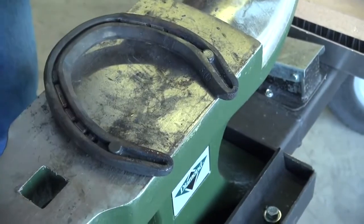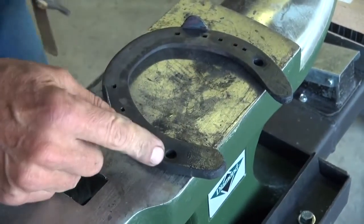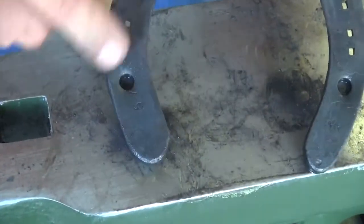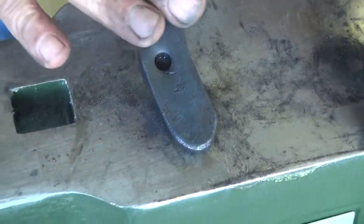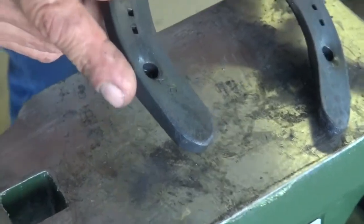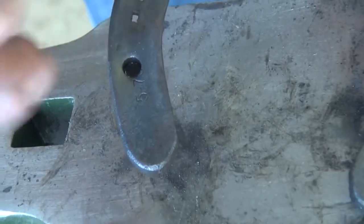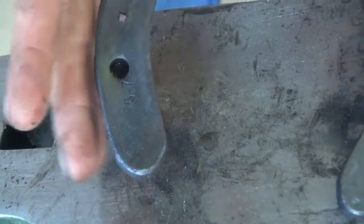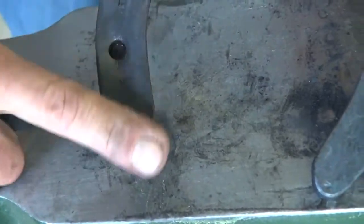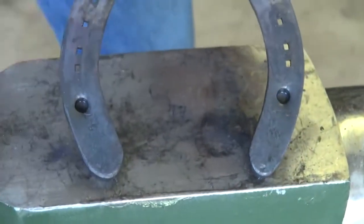So as with every punch that you drive into a piece of stock, you notice that material gets pulled down with it. You can see the shadows here. Now we can come back and smooth this out more flat. This little bulge right here — if you hit that with your hammer, it'll close up your hole. So we address this with a grinder; we don't touch that with the hammer. But we could run this a little flatter and get a little more of a smooth surface in contact with the foot.